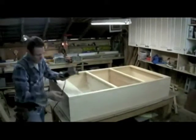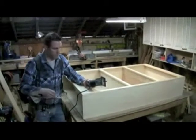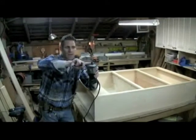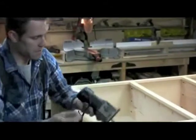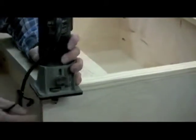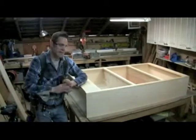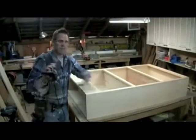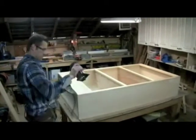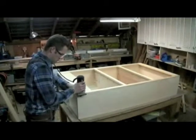Now it's time to flush trim our side. You could leave it with that little bit of a lip, but when you try to wrap the base and the crown, it's going to give you all sorts of problems. What I use is simply this bit with a router - this is a flush trim bit. The bearing's on the bottom and the cutter is on the top. I turn it on, push it against, and this bearing will run right up against this plywood and cut it flush. It's a nice way to ensure a nice flush outside. Anytime you're using a router, make sure you're working safe - two hands on the router at all times and make sure the router base is flat on the surface you're routing.